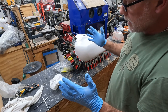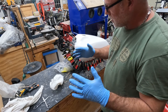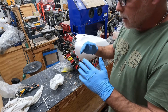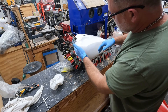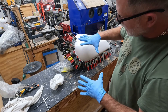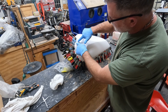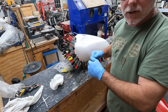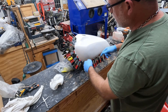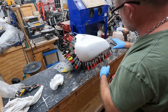When you lay up a mold, shrinkage causes the mold to collapse in a little bit. What I have with this top part is the sides are tilted in just a small amount. So when you put the bottom section in, you have to spread the tank — you've probably seen me pushing my fingers apart trying to line up, because I'm trying to align the parting line with the actual bottom part.